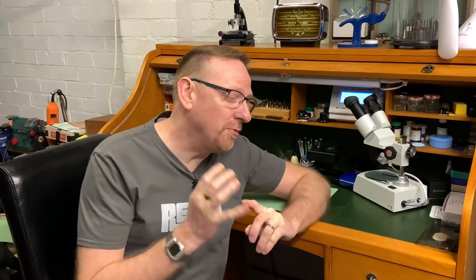So hopefully you saw the first two videos in the series, which was the disassembly. Now, the movement that came to me was from a guy called Jeff. It was in quite poor condition. It was very sad, very dirty, and it took 3 to 4 washes, actually, or cycles through the ultrasonic and through the watch cleaning machine in order to get the parts to what I would deem acceptable. However, there was some damage to one part. There was the part that was missing, which was the minute recording wheel, if you remember. And that posed a bit of a problem.